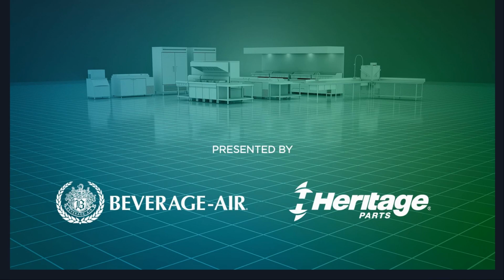So it's, yes, charge vapor only just because the charge is so small. So it's going to pull that vapor in extremely quickly. And you can charge as a liquid. There's no regulation stating that you can't. Charging as a vapor is just more exact when you're dealing with such a small charge.